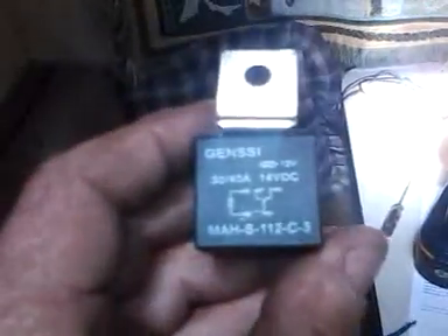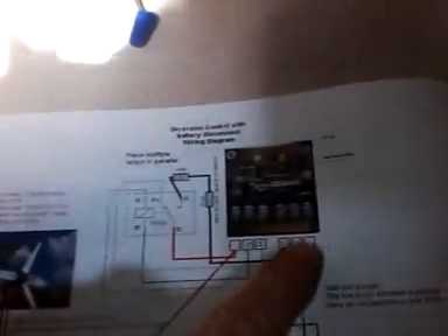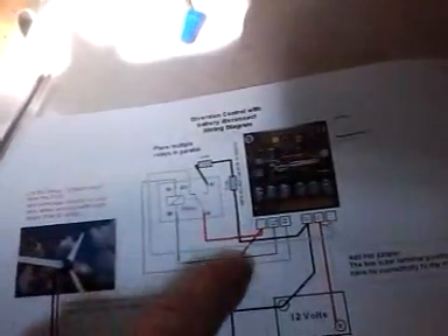It's got that heat sink and you can add more on if you want down the road. This relay — the way it works — you've got two wires to control it, this yellow and blue wire, that's what activates it. There's a little solenoid inside. When the solenoid is closed — normally closed — it's charging my battery. But when it gets to a certain point, it kicks that little bar over and sends the power to whatever load I want.